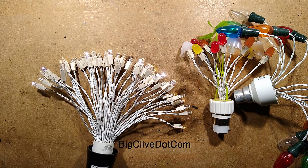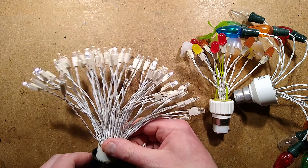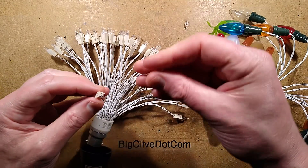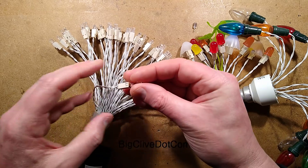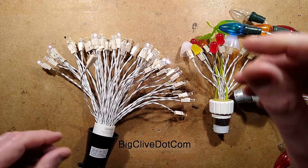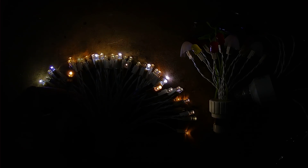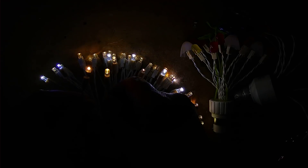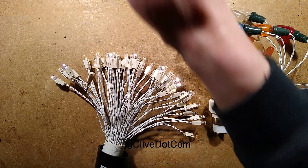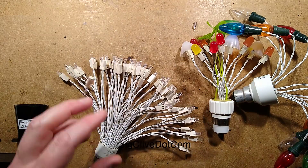What if I, just for comparison purposes, take a fresh LED like this, unplug this momentarily, take this one out, plug the new one in - noting that it's got long leads that are live - and then plug this back in. Let's see how bright this one looks compared to the others. It's relatively bright compared to the others. You can see a modest intensity difference, but these ones are side emitting while this one is emitting all its light over the front with a really wide viewing angle. The point of this was that over time the LEDs degrade and they do lose their intensity.